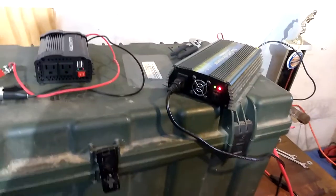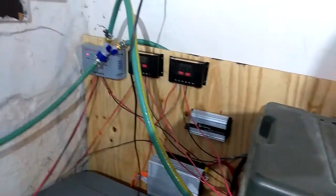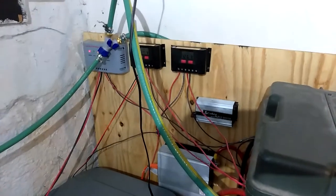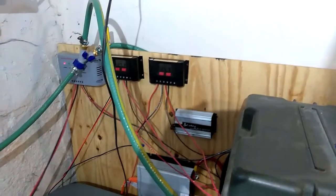Because your voltage changes constantly — you'll be at 119 volts one day and 124 volts another — this syncs with the outside grid power. Now I have power coming in and going through to the extension cord. If nothing's running right now, that would run my meter backwards. This makes everything so much simpler, so I don't have to worry about losing food.